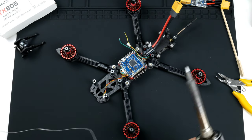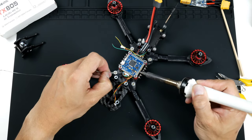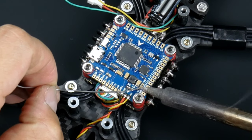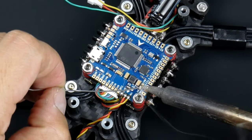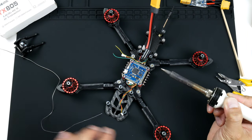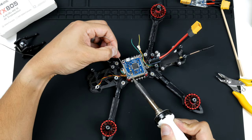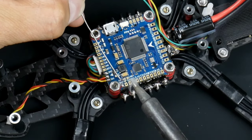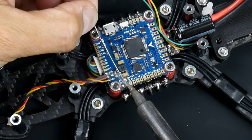I'm putting flux on all of that, and I'm going to put solder on all of them and also bridge the 9-volt regulator pad. I'll add a bit of solder there, and a bit of solder on that one in the middle — and it should bridge. That's a nice clean bridge. I'll add solder to the pads as well — so we'll go on this side for ground.